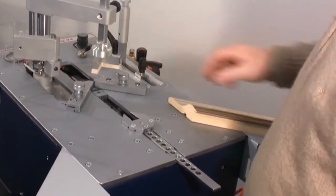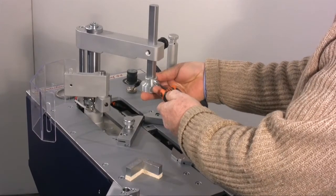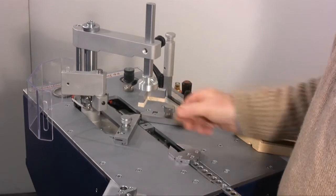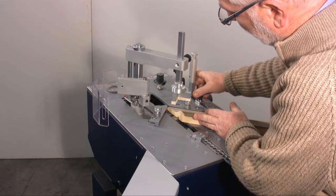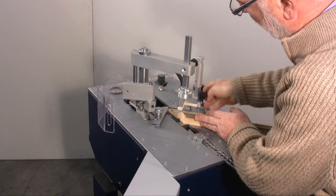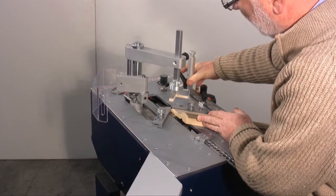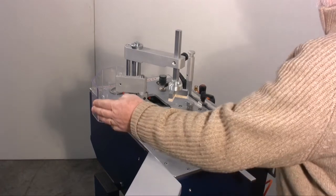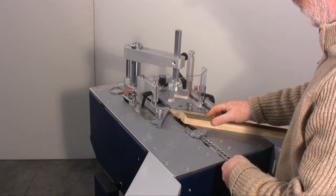Let's now see how to assemble a wider frame with a slightly irregular shape. A circular felt buffer is necessary for this frame as it fits better to the frame without damaging it. The vertical presser has to be positioned at about 2cm above the corner. You have to firstly set the two positions of the corner in which the wedges will be applied by tightening the two levers.